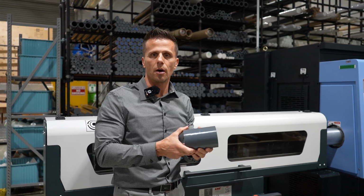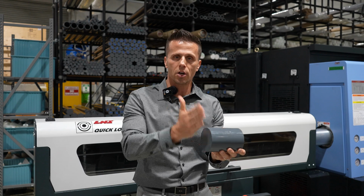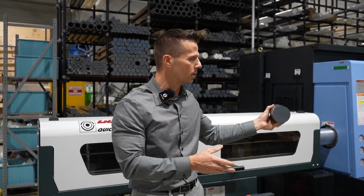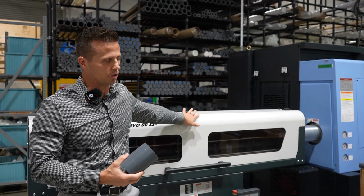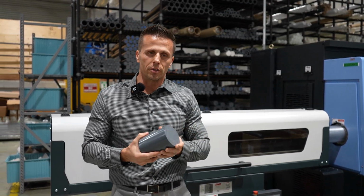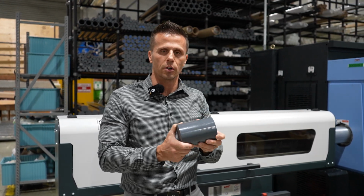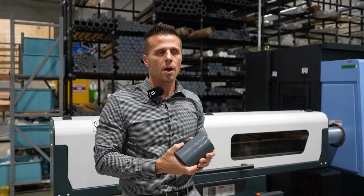So basically, a person doesn't have to take this particular chunk, number one, cut it into different size chunks, and then manually load it into the machine. You just load one bar into this bar feeder here, and then the machine will actually pull it through and cut the parts. Obviously you can understand that leads to automation. People don't have to do it on their own. You could actually have that machine sit there for hours at a time making parts for us.